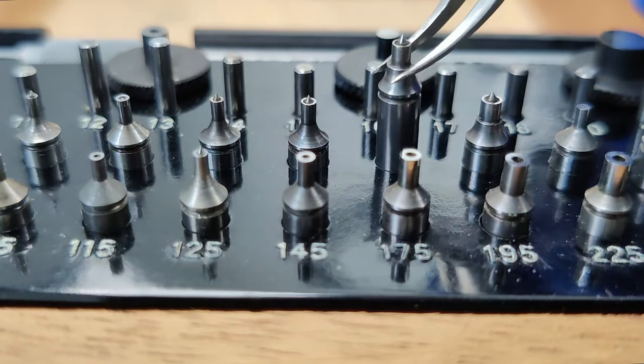Here's the lever sitting in the plate. I'm going to try to bend the tab so that it's more upright, and that way it's easier to catch with your finger. See how the bend in the lever causes the end with the tab to lean back? If we can take out that bend, this will pull the tab forward, creating the profile we need. Prior to shaping steel, I know it's important to preheat it to prevent it from snapping. Now once heated, I'm going to do my best Lord of the Rings Dwarven blacksmith impression and flatten the lever in the staking set. And here's the end result on the left compared to the untreated lever on the right.